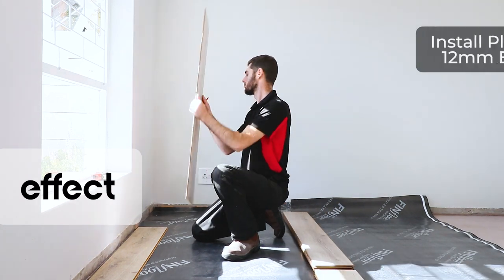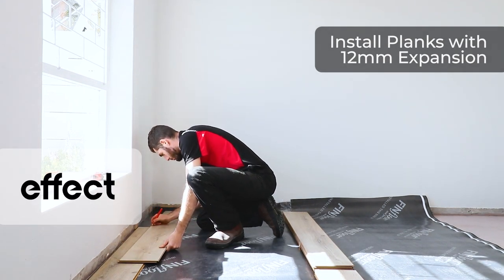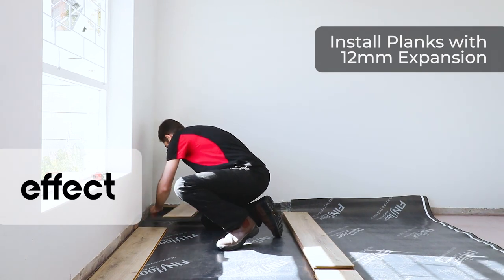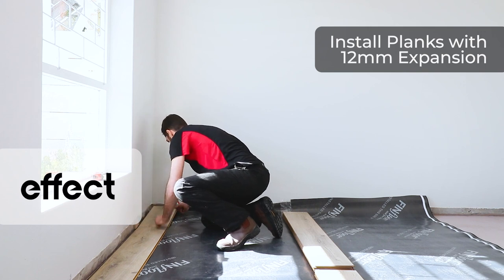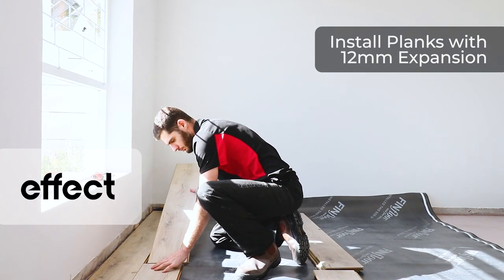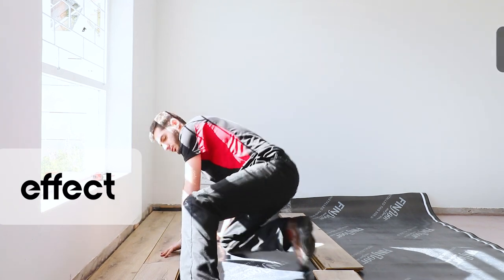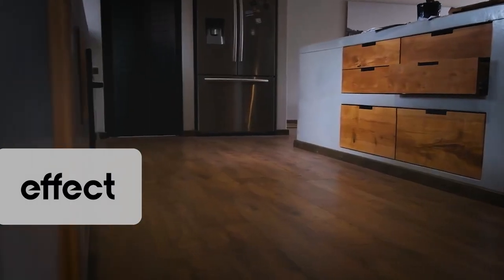Header to header, we want to make sure that the panels exceed a minimum of a quarter of the panel. I mark the 12mm expansion on the end and my colleague cuts the panel for me. I then fit the header in at a 33-degree angle, making sure that it fits snugly with your 12mm expansion against the wall, and that the underlay still wraps up 50mm up the wall, preventing any excessive moisture from the slab or wall from penetrating the cut joint and exposed core. Once done, repeat until you get to the filler.